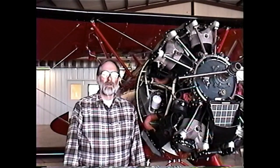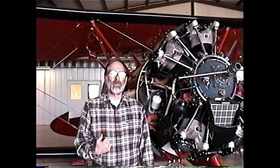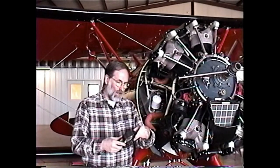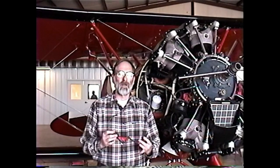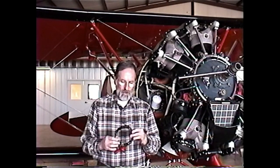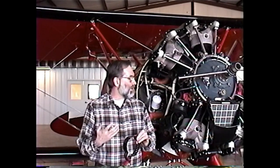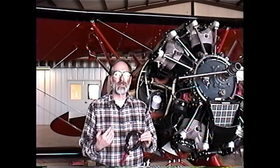All right, we've got our cylinder put back together and repaired, so now we're going to reinstall it. We will need a ring compressor, and my personal favorite is the wrinkle band style. It's easy to get off once you've slipped the cylinder on. And so we'll use the wrinkle band ring compressor. And basically, reinstallation is just the reverse of removing the cylinder.